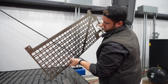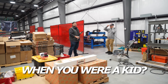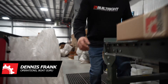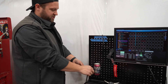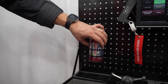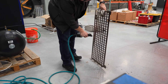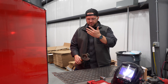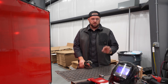Pretty good cut — pretty good sized panel. We've got these cut, so let me use a wire wheel to quickly buzz off some of the dross off the back. It's a pretty clean cut. Then we'll bend them into position and tack them so they stay there, and probably hit them with some paint so they look like finished pieces.